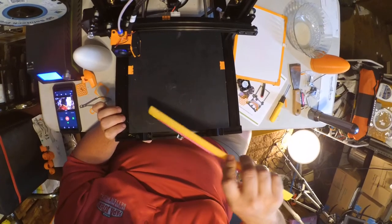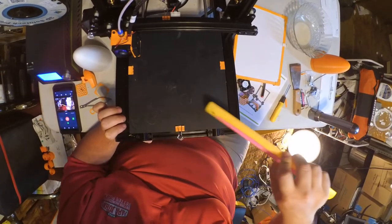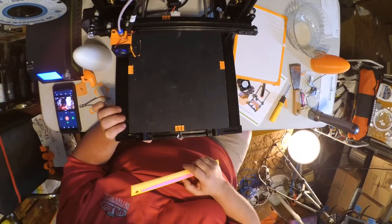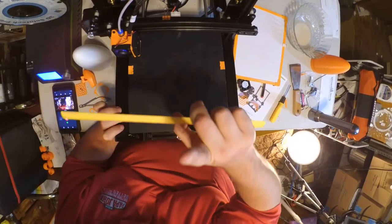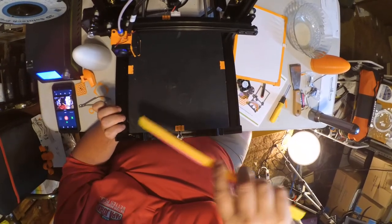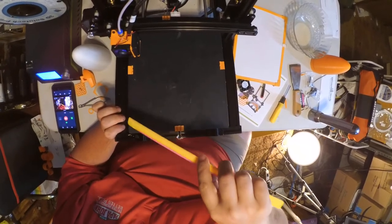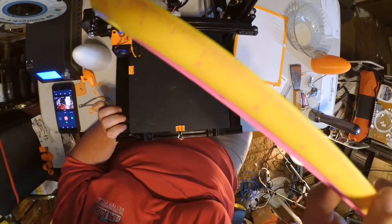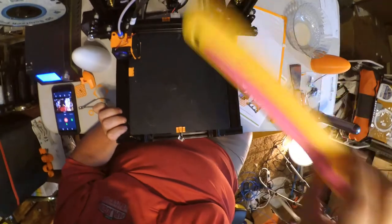So when I set my parts up, I go from this side to this side, I can be 22 millimeters away. So I usually do 25 millimeters to give me a little buffer. And don't forget your skirt. If you have a skirt, you have to add that dimension into it. All right. Although you usually only need a skirt for the first part. You usually don't have enough oozing going to your second part. You're usually okay. Unless it's tall, then you might need a second skirt because it might ooze while it's going up and down.